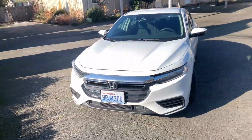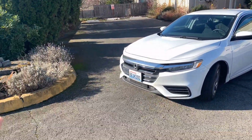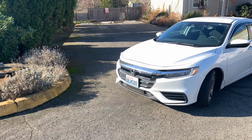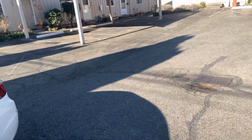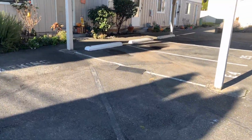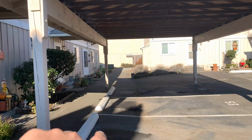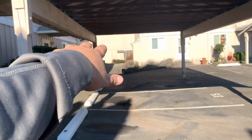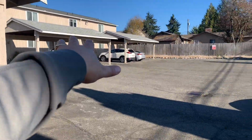All right, so this revision 2 is to do a full depth grind and overlay of the entire south lot. We're also going to do the same thing up on the north lot. So just to give you an idea of the boundary lines, it goes behind the carport, and it actually goes through this walkway over to that gravel. So we're going to include that area right there as well. So full depth, 3-inch grind, and then overlay this whole area.